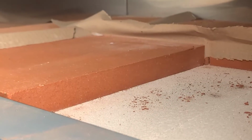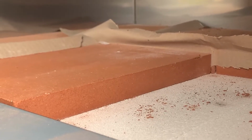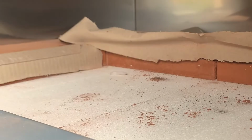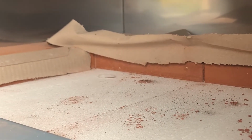Let's also talk about the Gasbeton lining under the fire bricks. This is a concrete thermal lining that makes up the floor of the oven. Now, I haven't gotten under this layer, but I assume that the oven is stainless steel bottom, Gasbeton thermal lining, and then the heat keeper fire brick to give us the base that we cook on.